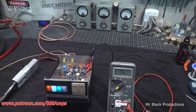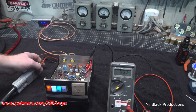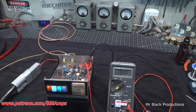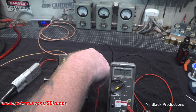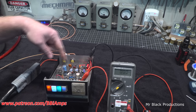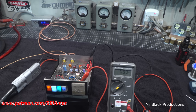Look, we got big power wire coming to this Anderson clip, way oversized Anderson clip going into the amplifier. Hello, 1 2 1 2. No voltage drop there. But when we come and we probe over here, the 12 volt goes through here, through a choke, through another choke, and then over to this resistor.